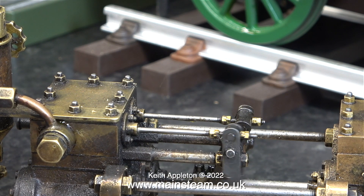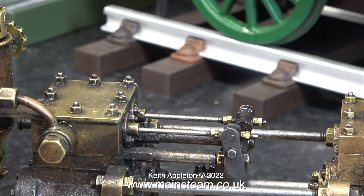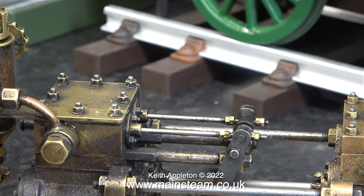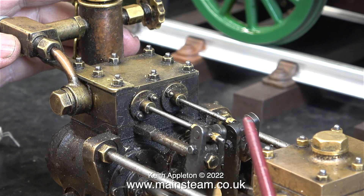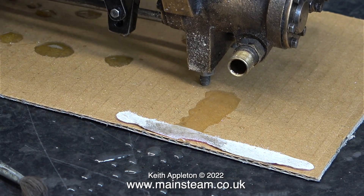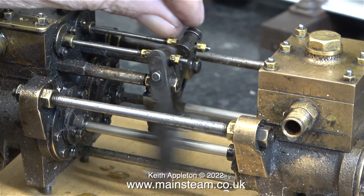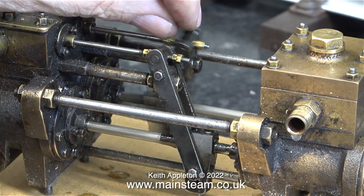The first thing I notice is that the beats are not even. It's possible by messing around with these pumps to get them to sound like a small locomotive — have a listen, see what you think. The clunk accompanied by a whirring noise is from my silent Bambi compressor — not as silent as I would like it to be. As the speed and tone of the engine changes, I'm interfering with the valve events manually. Health and safety notice: I don't recommend doing this because it's quite dangerous and you can hurt yourself. Always keep your fingers well clear of moving parts on steam engines.